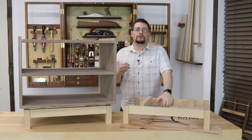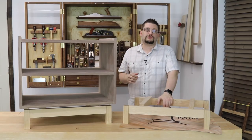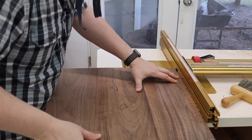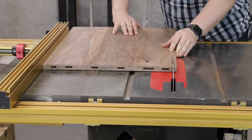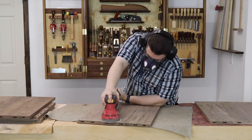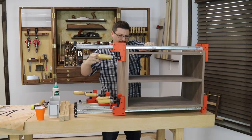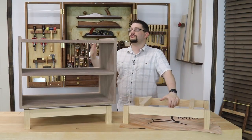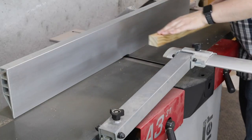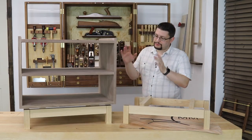The next step was to mark out where I wanted to create the rabbet on the back of my cabinet. I marked that out, then went over to the router and slowly removed all of my waste. Once I had done that, I was able to go to the table saw and make a rip cut, removing the same amount of material as the depth of the rabbet. Then it was just time to do a whole bunch of sanding and glue this up. I needed every single parallel clamp I had — my parallel clamps are 24 inches, but this is longer than 24. So I also created some boat clamps from pieces of pine, and I used my steel beam clamps to pull in the center of the cabinet where the shelf is, to get everything nice and flush. So that was the cabinet glued up.